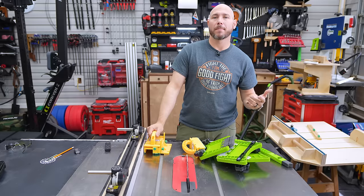And then there are feather boards. Feather boards help keep your stock pushed against the fence, similar to the stock guides. So if you don't have stock guides, this is the next best thing. I made a video on five different jigs on how to use these in various ways to keep vertical and horizontal pressure. These Bow feather boards are fantastic, and because they're made of EVA foam, if they do get into the blade, they're not going to throw shards of plastic back at you — it's just foam. The replaceable inserts are a great feature too. They won't mar your wood but give plenty of pressure against the fence to help prevent kickback and keep cuts accurate.